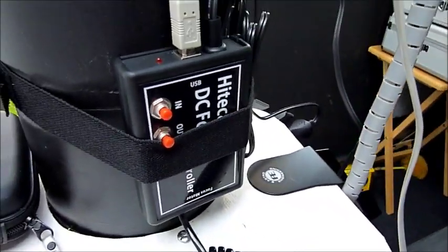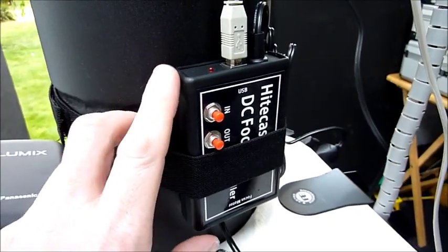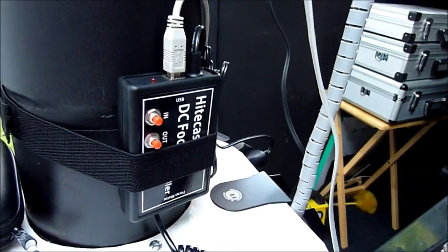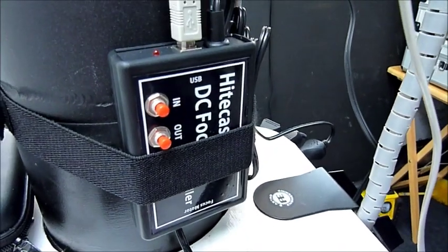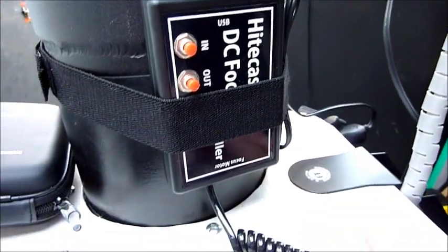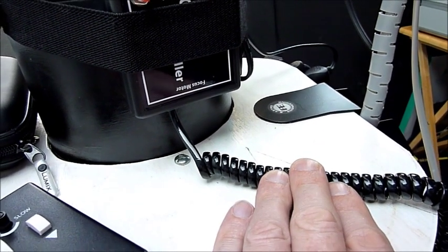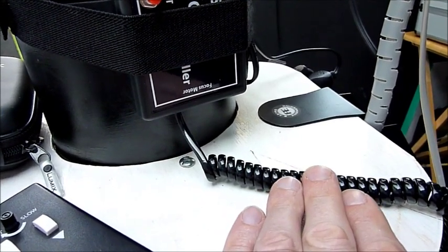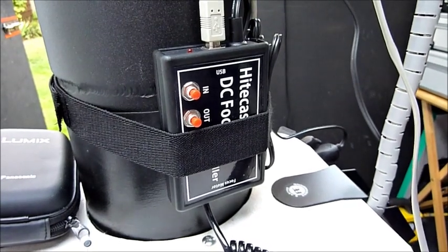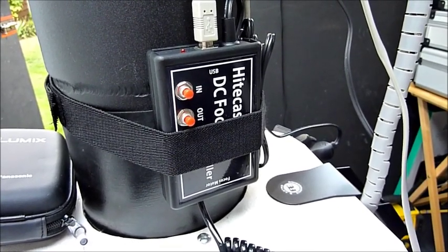Now, what I use with this is this high-tech Astro DC focus controller box, which has a manual in and out, so you're not losing the use of the handset box. It's just you can't control the fast and slow. You don't get that on this box. But what you normally do then is connect that via USB to your PC. It's got a 12 volt connection there. And then the other end goes to your controller. I've bought an extended cable. You can buy a 6 meter RJ10 connection. It's a telephone cable. On eBay for about £2 or £3, I got that bargain. And then you can control your focusing system through FocusMax if you're using CCD Soft or Maxim DL. Thoroughly recommended, as the focus, once it's been trained via the V curves, is really spot on.